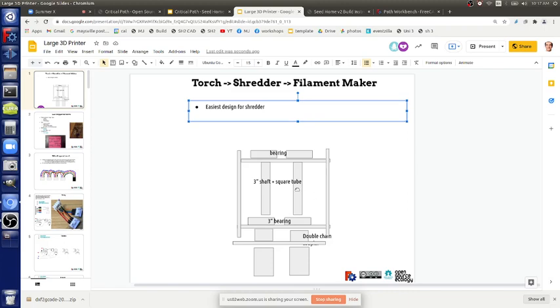When we've done that with our smaller shredders, we've got the smaller shredder parts here. You can see that stuff fell through, but here you probably want larger holes. If you're doing half inch shreds, it depends on the spacing between the blades. Whatever falls through is limited by the size of the aperture when the blades are going past each other. If you've got half inch, you don't expect particles larger than half inch to go through, unless it's a long strand of something.